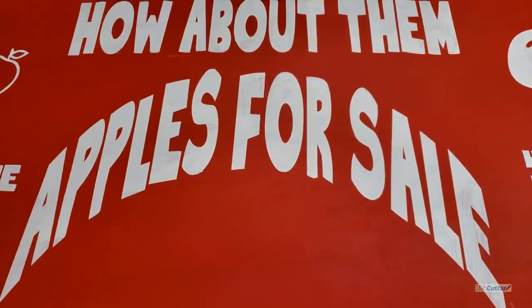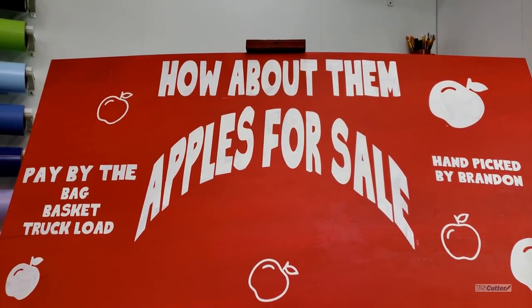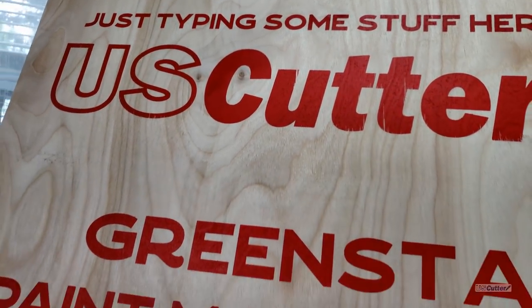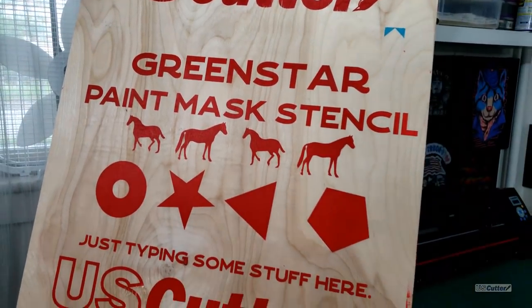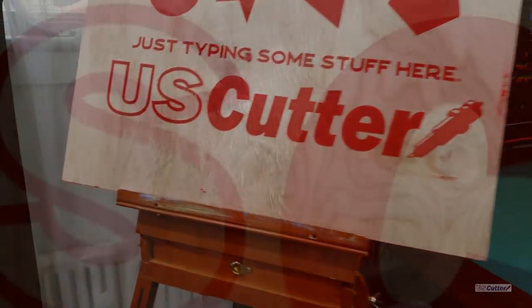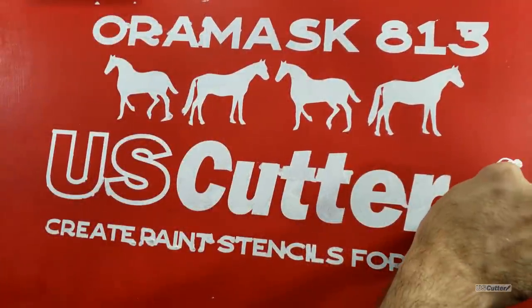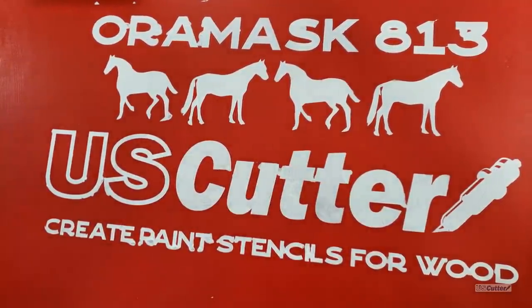How about that beautiful sign? I did this example on a sanded surface, so what if we didn't have a sanded surface? For example, when you apply the mask to a rough surface with some splinters coming up — if the surface isn't painted the paint mask will stick pretty well to it. The issue is when you're removing the paint mask: some of those splinters will raise and stick to the adhesive. When I tried to apply the paint mask to the painted side, I had some issues keeping the paint mask stuck to the painted wood, but I was able to get it to transfer. I did have a few rips and tears, so the final result was pretty bad. Keep these things in mind if you're about to start a project.